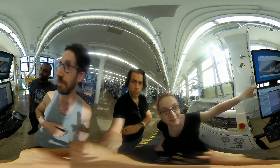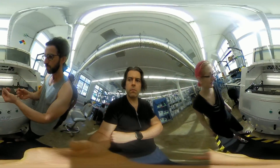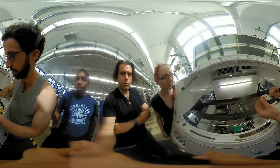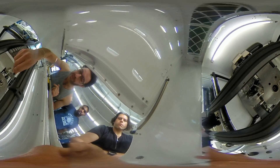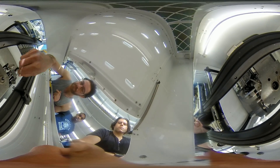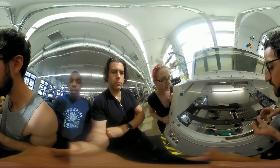So now I've lifted my nozzle up here. We were down for a bit so it's cooled off considerably. What I have to do now is take a titanium probe — it's just a piece of titanium wire, but it's titanium because titanium floats in solder and deflects heat better. So I can actually hold onto this and stick it down into the nozzle carefully — I don't want anything to shoot up. There we go. I've cleaned out the nozzle, and now I'm just going to dress the tip of the nozzle.